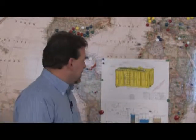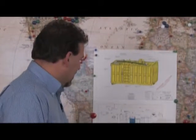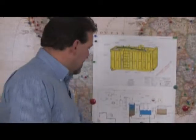For well over a year now, Water Blasting Technologies has been producing water recycling units and sending them around the world. You'll see here a unique patented process that allows us to take in fresh water, run it through a series of filters, and then through some very clever processes and inventions, we recycle that water straight back into the clean water tank and lose only about 200 gallons per day to evaporation and efficiency loss. We've run machines for over 2 weeks without ever changing the water in that machine.